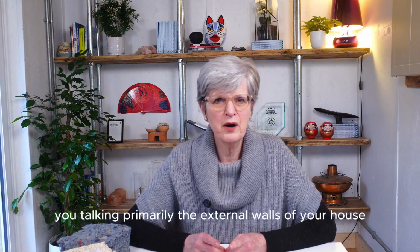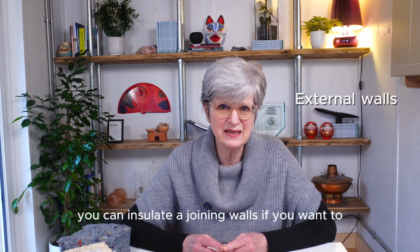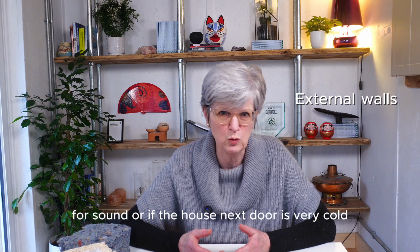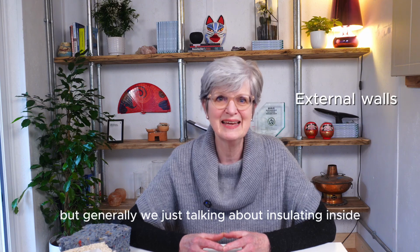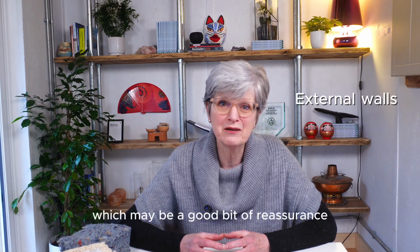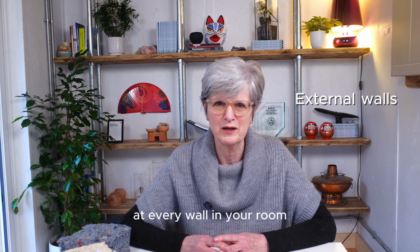Remember, you're talking primarily the external walls of your house. You can insulate adjoining walls if you want to for sound, or if the house next door is very cold. But generally, we're just talking about insulating inside the outside walls, which may be a good bit of reassurance if you're worried about space. You're not going to be building out every wall in your room.